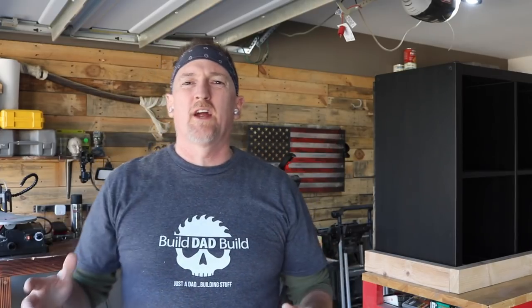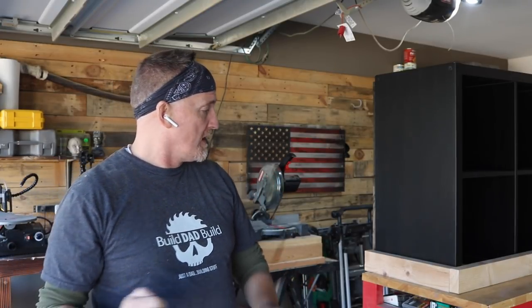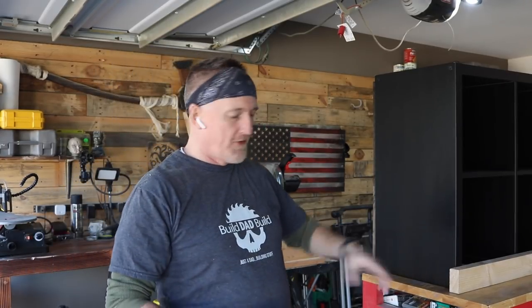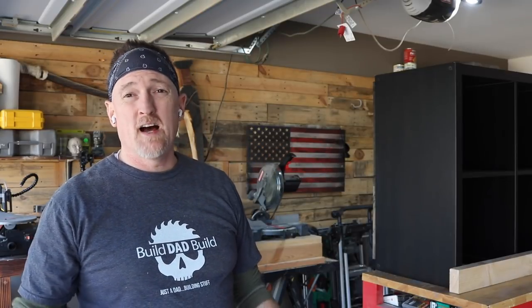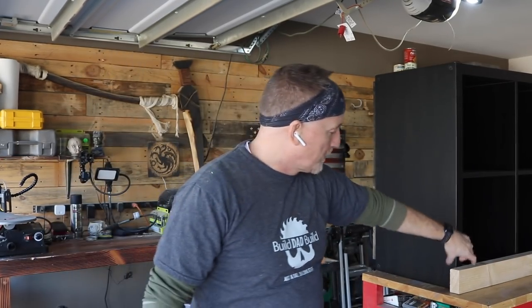Later. Okay, I thought it over, and if I do each individual piece, I think I'm going to waste time. So what I'm going to do is the first three pieces. I'm going to cut this piece right here to fit. Then I'm going to measure off of this one to the next one, cut that one to fit, and then measure off that one to the next one. And then I'm going to burn all three of those pieces, scrape all three of those pieces, and go from there. And then if anything needs to be tweaked or adjusted, I will do it then. If not, I will continue to do the top, take a look at it, and decide if we do want to put these pieces in here or not, because I still haven't decided on that.